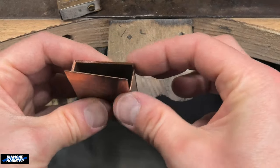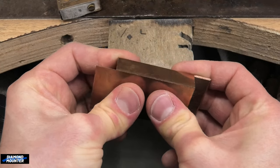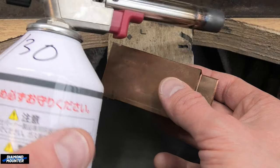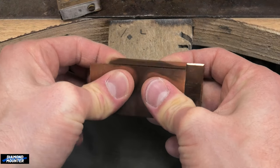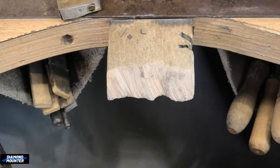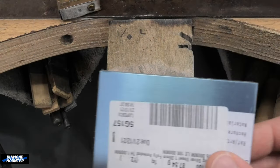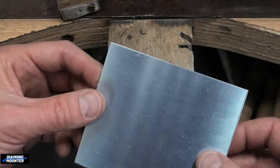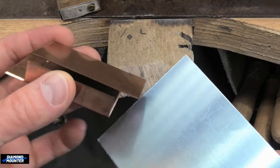I had quite thick sheet of copper. I couldn't get it hot enough even with easy solder, trying with a butane torch. I managed to just barely tack it shut after about 10 minutes of trying, then I thought I can't continue like this and put it down for months. I wanted to try again, so I got a thinner sheet of silver — inspired by having that solder paste recently, which melted so quickly. I thought with thinner silver and solder paste I could continue with it.